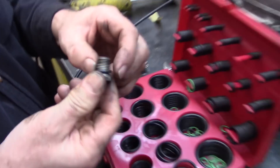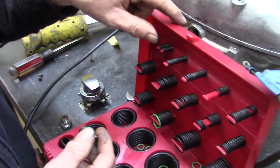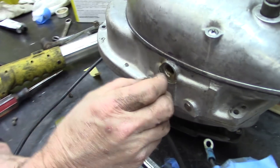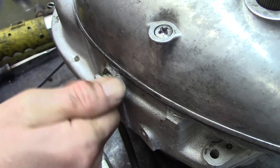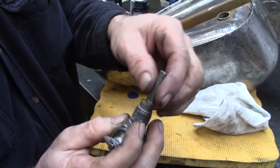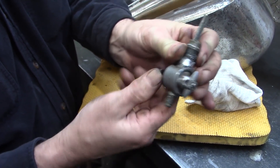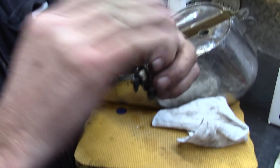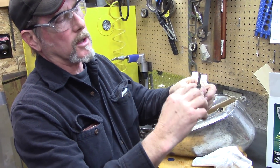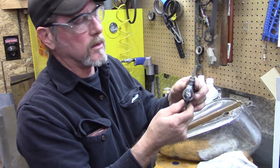These didn't have O-rings. They've got a chamfered slot in here — the threads don't seal it; it's not a pipe thread. This has a taper, and I thought that would seal it, but I'm thinking it's supposed to have an O-ring in here. This one's a little loose. If it stops and we can't even get to the taper, then it doesn't work. That'll work — it's perfect. What this had was a torn screen and it was all corroded with white stuff in it, and these holes were clogged. So we blew stuff through and freed them up. If you're running the tank down to that level, it would start spitting and sputtering. Then you flip it to reserve and you get a bit more fuel coming down — it all goes through a pretty fine hole, but this is all freed up.